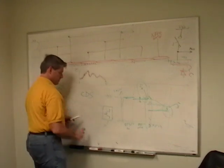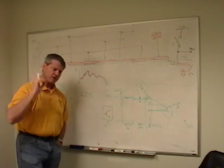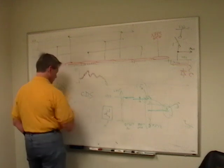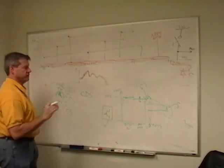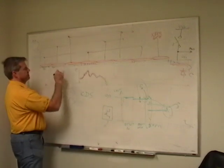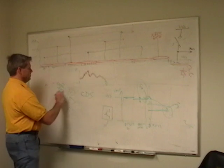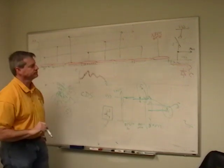So one of the ways you can get rid of that is what's called hydrogen passivation. You stick this in an oven full of hydrogen, and a hydrogen molecule will come in here and fill that up. You leave it a long time, so it has time to get down through the silicon dioxide and everything and cook it. It's a pretty high temperature. But that's called a passivation step, and now you get rid of some of those electron traps.